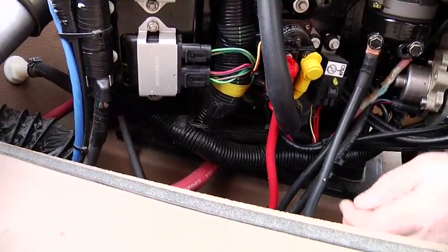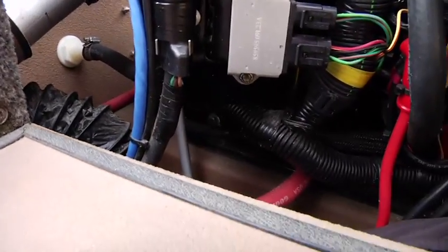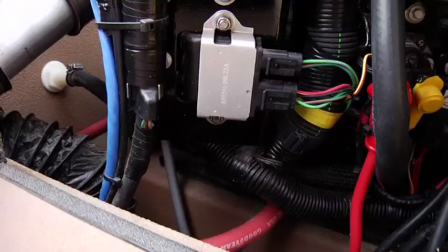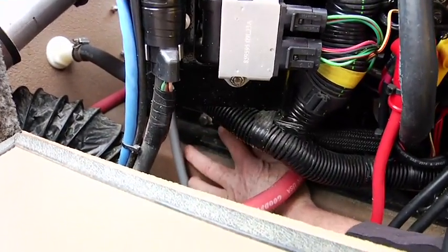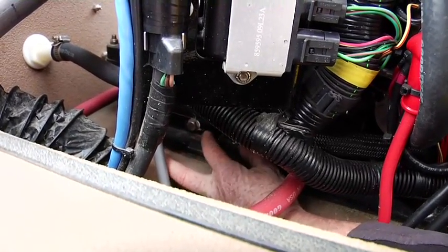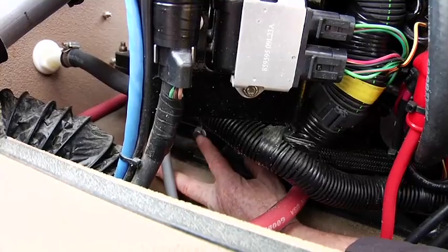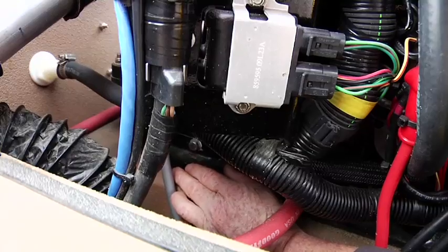To locate the little winter drain bolt, go to your bilge pressure hose that runs off the jet and goes down to the bilge area. Almost right behind there on this engine base plate, you will find your little bolt that's threaded and goes into the engine adapter plate. All you have to do is put a socket on there and spin it out. I believe it's 9/16, and you take it out. It's about 3/4 to an inch long, and it has a washer on it.